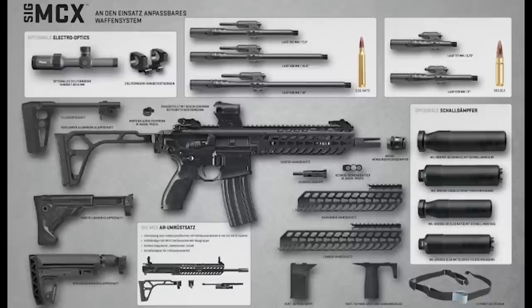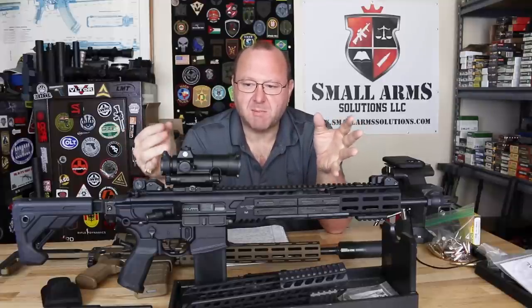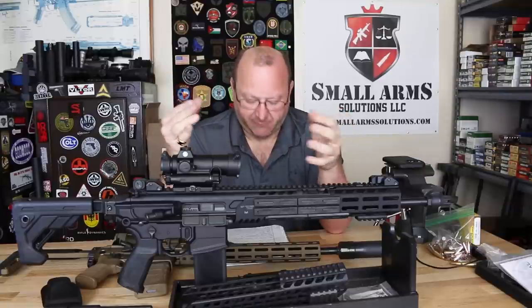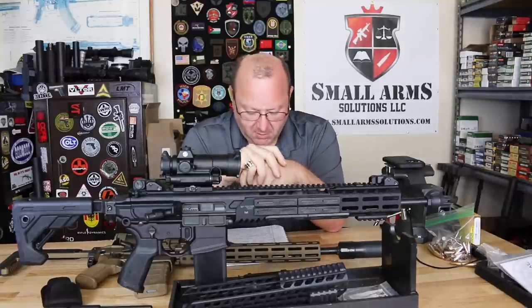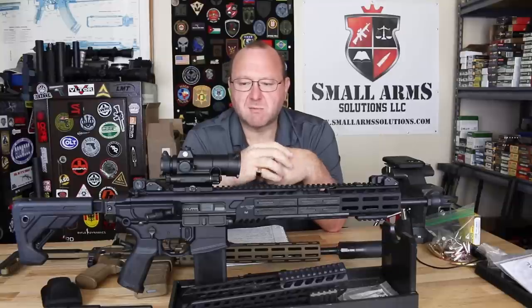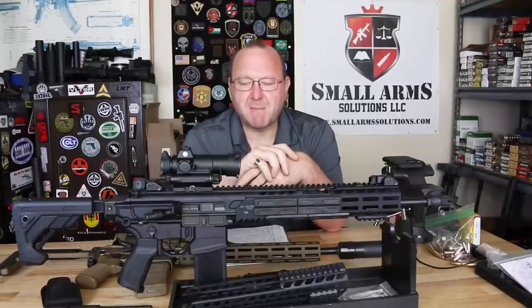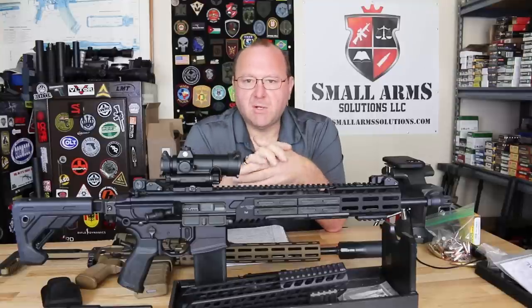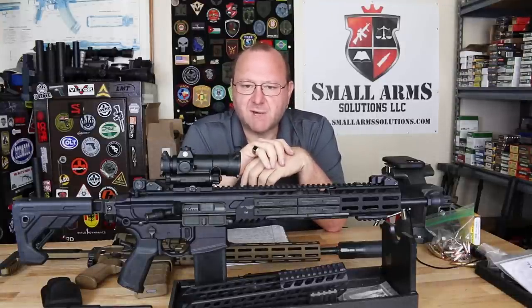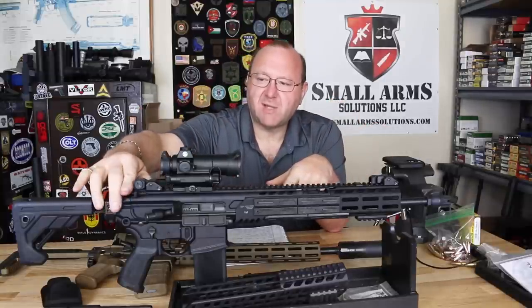Basically, they wanted the new system to mirror all the M16 type controls because the M16 has the finest human engineering of any rifle in the world as far as the way you manipulate it. Your hand is on the pistol grip, and everything is within sweep of your hands. You don't have to adjust your grip for anything. There are some modifications over the standard M4: a better magazine release, a much larger and easier to reach bolt catch, an ambidextrous safety, and an ambidextrous charging handle. It utilizes the standard M16 fire control group minus the automatic sear, which was standard mil-spec in the initial design. They kept the familiar charging handle as well.